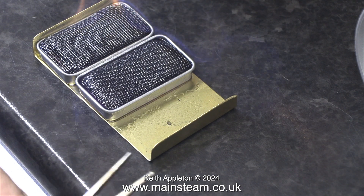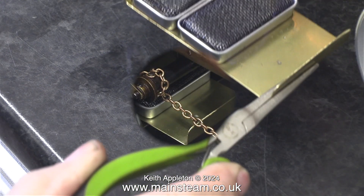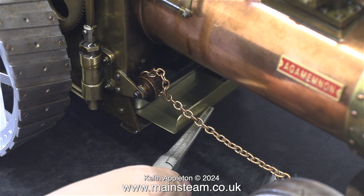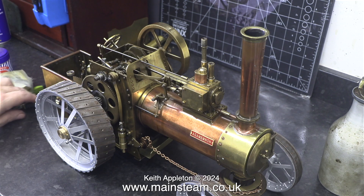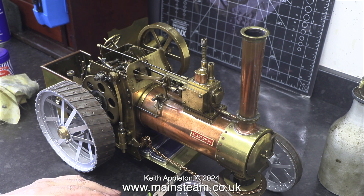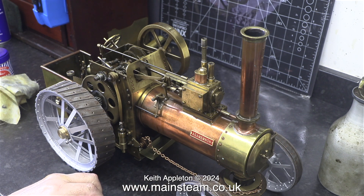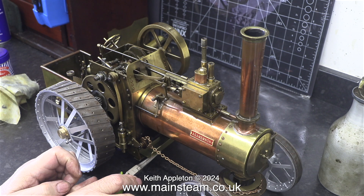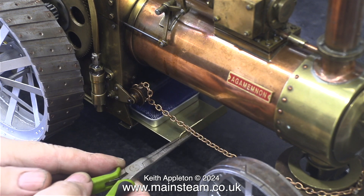With all the excess methylated spirit safely removed it's time to light the burners - this is new territory for me, I'd never used them before. I carefully picked up the burner assembly using a pair of long-nose pliers and placed it in position in the firebox. I immediately had a problem: when I pushed the burner tray all the way in, the burners went out because they were too far back in the firebox where there must be a shortage of oxygen. I experimented with the positions and found a position where they didn't go out. Here I'm just checking the burners to make sure they were both lit - and they were.